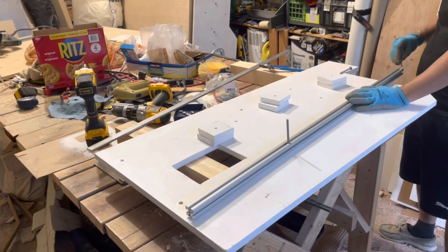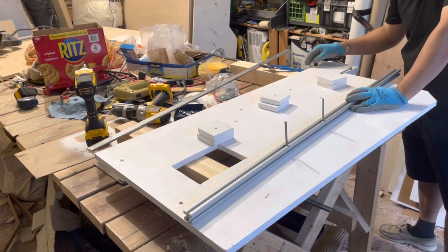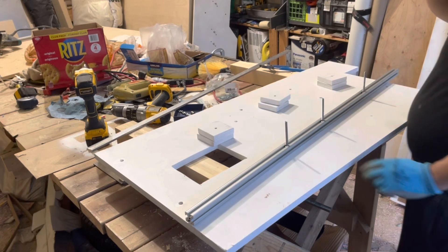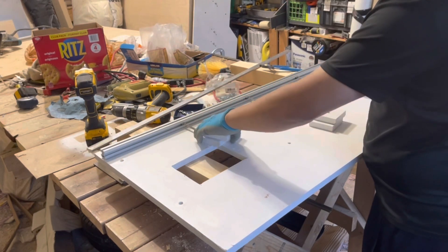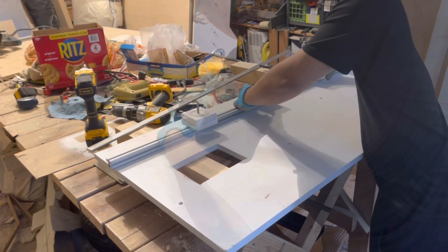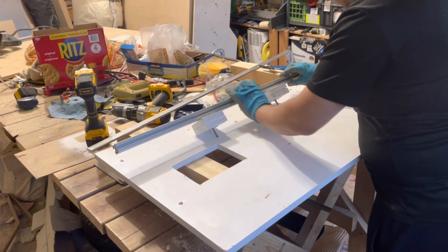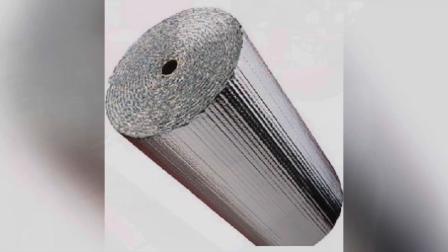After the paint, I put the 80/20 aluminum on those spacers using 3-inch long 1/4-20 stainless steel carriage bolts. This carriage bolt has a square neck that can slide into the 10-series 80/20 slot, then go through the base spacer and the plywood. At the back side of the framing, I'm using a washer and nylon lock nut to secure them. The benefit of pre-installing the 80/20 this way is we can use bolt and nut fasteners. If the frame panels were already installed onto the wall, we could only use wood screws, and the strength would be much less than bolt and nuts.